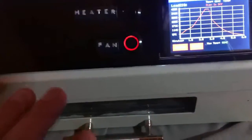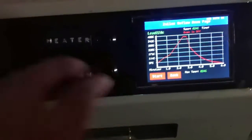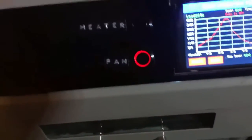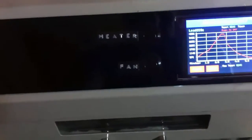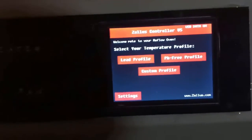Same with the fan — I mainly added the manual fan override as a safety thing. If things get too hot or something, I can just quickly keep the fan on. You can also set this controller to turn the fan on and off once the reflow is finished, but if you want it on longer — which I normally do — I normally just override it once it's finished just to keep it on until everything is nice and cold. You could also reflow manually like that without using the controller profile. That's basically everything really. This is a really good controller for these ovens.